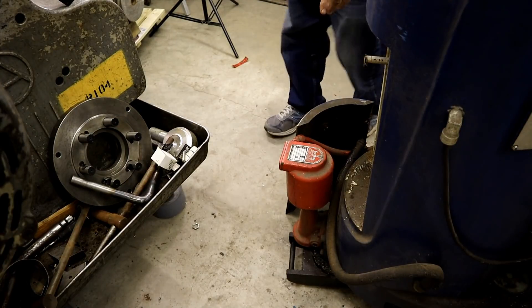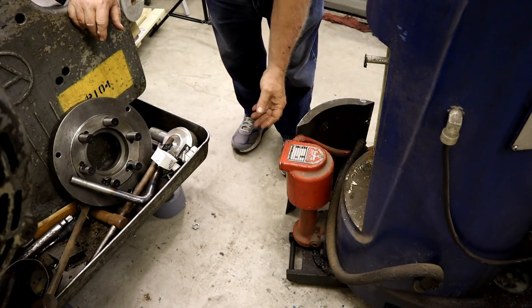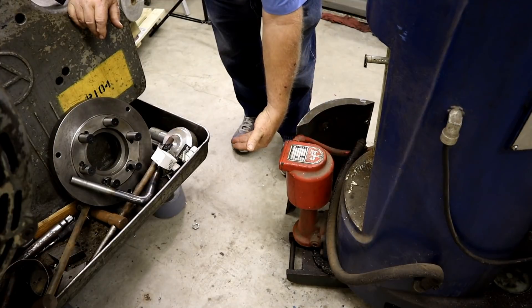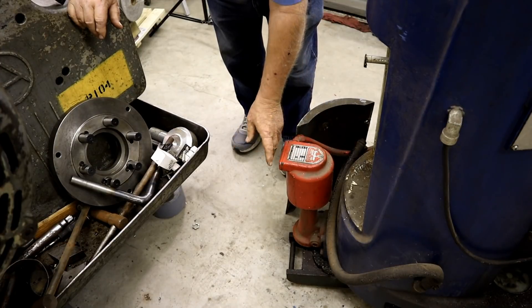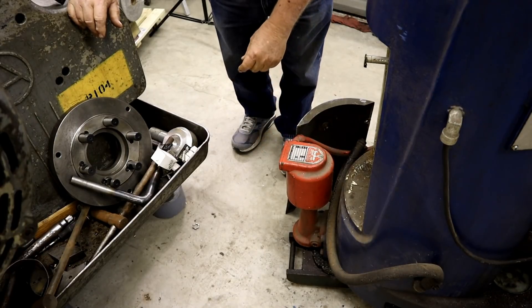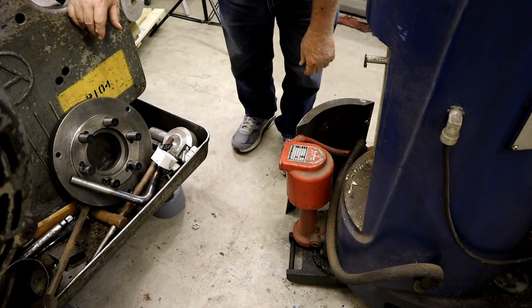The fourth motor is this little gusher coolant pump right down here, and this one was the hardest to work on because the pecker head is very thin. You take off the cover and the wires come out, and they were labeled atrociously. I finally found some markings on the wires and got everything sorted out that way.